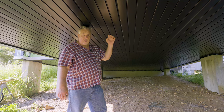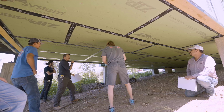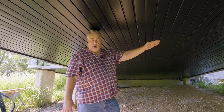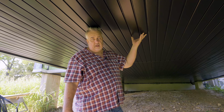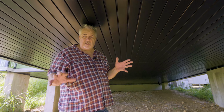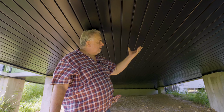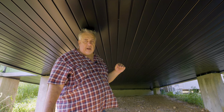Below that floor truss, we have a ZIP R9 panel, which is a laminated polyisocyanurate to the ZIP sheathing product. That provides R9 continuous across this plane, in addition to that 14-inch floor truss that has blown cellulose in it. That's at roughly R60-ish, right? So let's just call it R70, we'll round up and make it sound good. We basically have an R70 floor system here that has that R9 continuous.